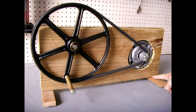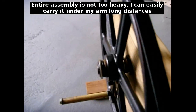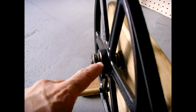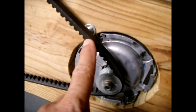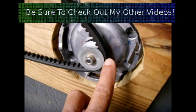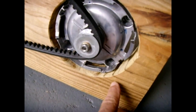The entire unit is made from a two-by-ten, and the two legs are made from one-by-twos, glued and screwed into the two-by-ten. The bottom has padding. Up close at the pulley back there's a bronze bushing, then a washer, then grease on the bore of the five-eighths bronze bushing, then a Teflon washer, a large washer, and an E-clip groove. There's a pivot point on the motor — on the backside a screw lets the motor swing downward to put the belt on and off. Once the belt is back on, you push the pulley and tighten the screw on the backside.